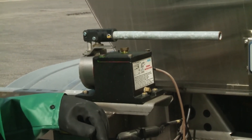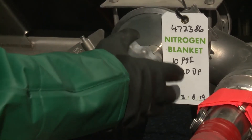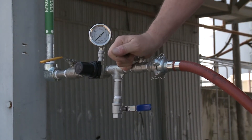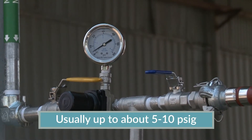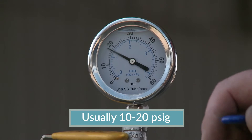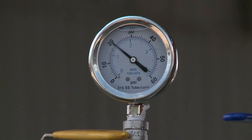Now the transfer operation may begin. Open the tank truck's internal valve and then carefully open the external valve. Then open the receiving line valve. Open the nitrogen inlet valve on the tank truck and then open the valve on the nitrogen or dry air source. Introduce nitrogen gas or dry air into the tank truck, usually about 5 to 10 PSIG. The product should now begin flowing through the unloading line. Once you have verified there are no leaks in the system, the nitrogen or dry air pressure will need to be increased to an acceptable pressure, usually between 10 and 20 PSI, depending on the desired rate of unloading. Maintain a constant pressure within the tank truck until unloading is complete.